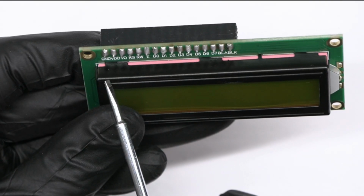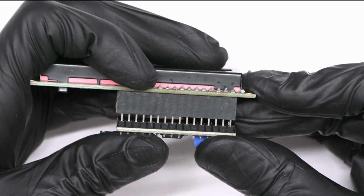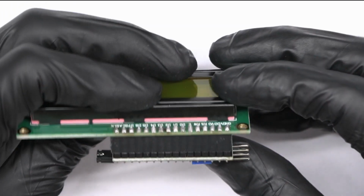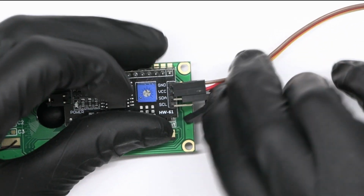Carefully align the I2C module with the LCD pins like this. If you want to know more about 16x2 LCD display and I2C module, click on the info button or link given below in the description. Now take the male to female jumper wires and insert them in the module.